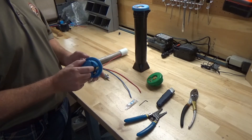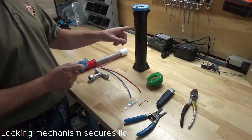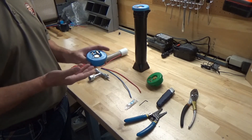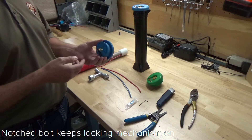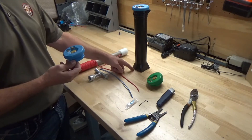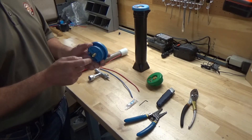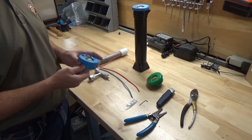There's a locking mechanism underneath this lid that secures the lid to the base, and it's controlled by a pentagon bolt. That pentagon bolt is notched at the bottom to prevent the operator from backing the bolt out of the top of the lid. If the bolt were to back out, the locking mechanism would drop to the bottom of the base, making it really difficult to retrieve and preventing you from being able to lock the lid. So that notched bolt prevents the bolt from backing out and dropping the locking mechanism to the bottom.